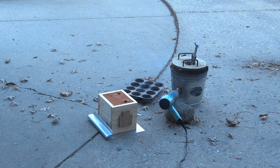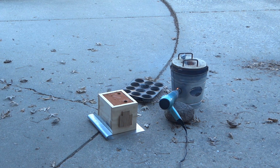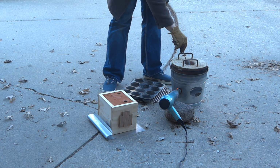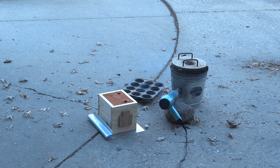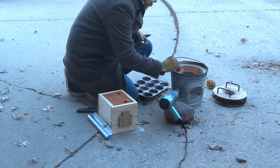Voiceover time. So here I am. I got the grill fired up. I got the mold out there. I got the cupcake ingot mold for when I have extra. And I am melting down some scrap cast aluminum from washer and dryer parts. I'm not using any of the ingots I had before, and I'm definitely not using the can ingots. Those aren't really that great for pouring. I'm using scrap cast aluminum. That's silicon containing cast aluminum, like I mentioned.